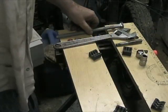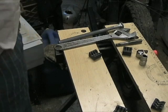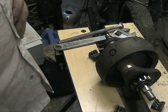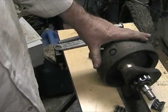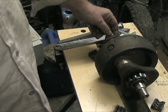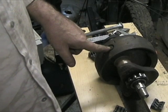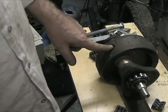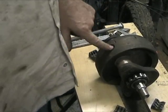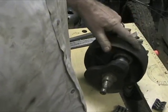So, let's get the crankshaft out of the bike. This is an early Triumph 650 unit construction crankshaft, but this one has timing marks, which pre-units don't have. It has a Whitworth screw to hold the sludge trap in, which later bikes have a 9/16.